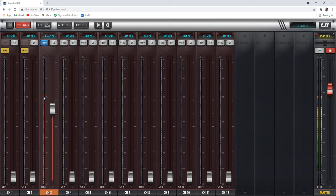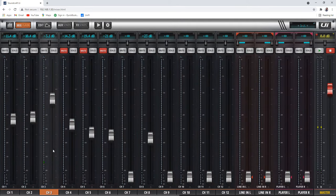You'll notice that we get a nice level here. When we're adjusting the gain, it shows us lots of level or not enough level. So that's a nice way for us to know what's happening when we're setting the gain. Over here, you can see that we have a bar that shows audio levels for this mic. Turn it down, it gets lower; turn it up, it gets higher. There's a blue bar behind that bar — that is the gain level — showing audio levels and then the level we're sending to the main mix.